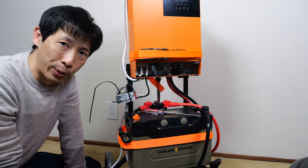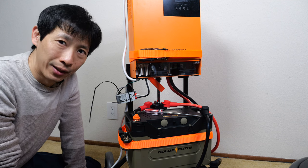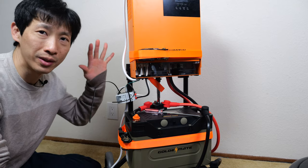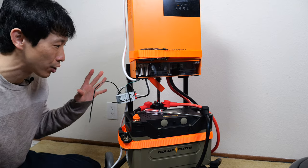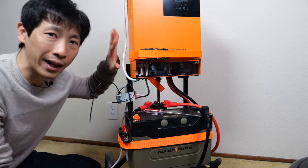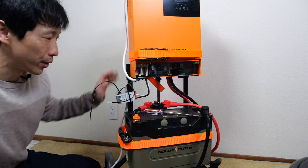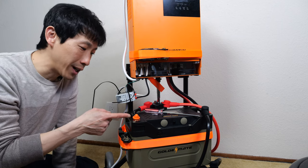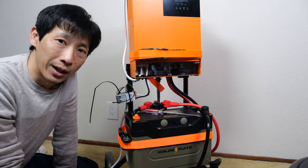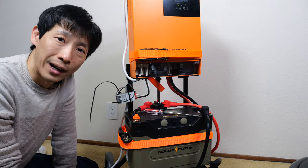These DIY projects are a little crazy — this is not kid-friendly. Don't have kids around this stuff because there are some potential danger spots that you don't want to touch. It's actually not intuitive to try to shield this off because you need airflow into the hybrid inverter. There are 24-volt contacts over here that you could accidentally short out, so you've got to follow proper precautions and not have kids around.